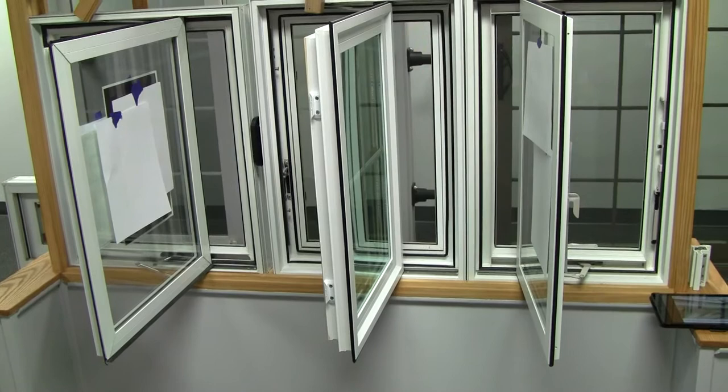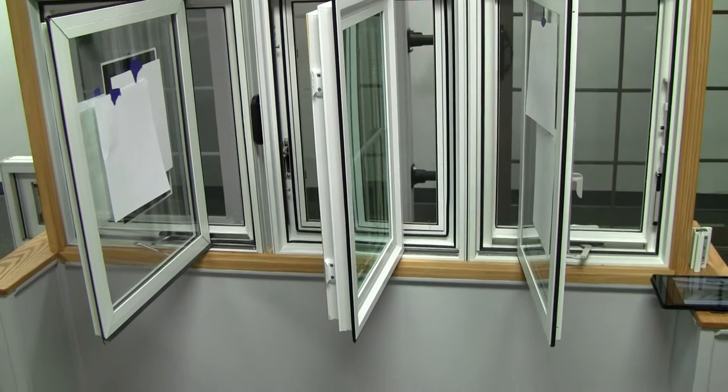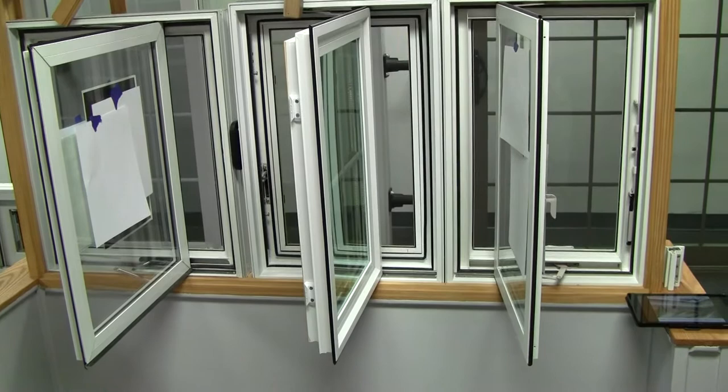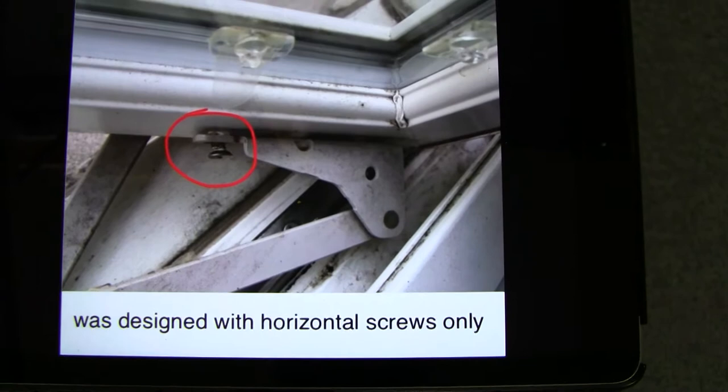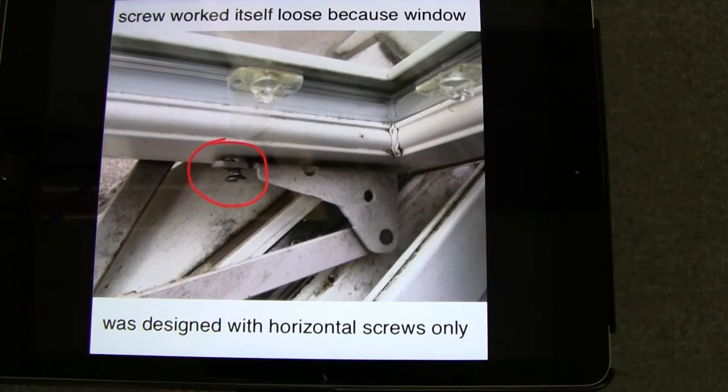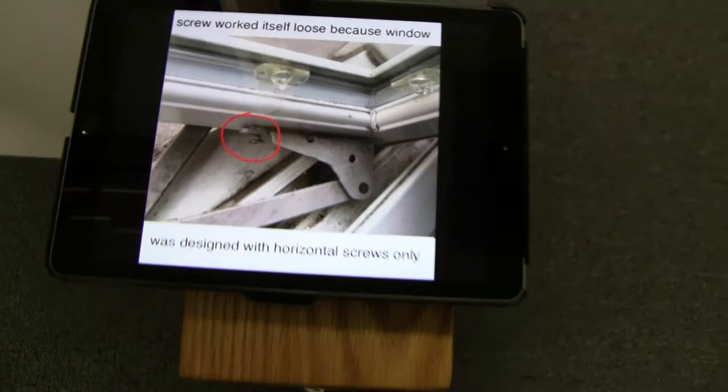Most customers, if they were to have these three companies out, would have missed a lot of the things I pointed out. We covered screws, how the hardware is attached, the type of hardware, where the hardware comes in from underneath, and whether it's heavy duty or normal hardware. This is very avoidable in casement windows, but unfortunately most casement windows aren't made to go directly to the homeowner — they're made to wholesale out to dealers, and that's what really limits them. You can't use better parts or better components. The majority of windows on the market are not designed to be great; they're designed to wholesale out to dealers and look pretty when they're new.